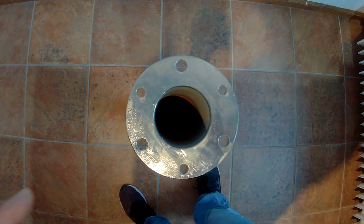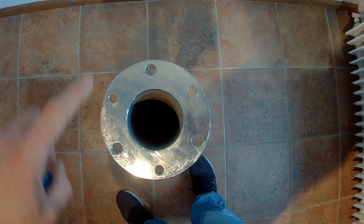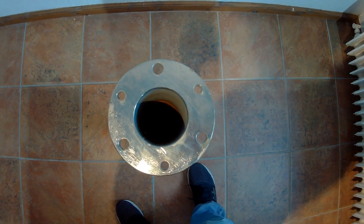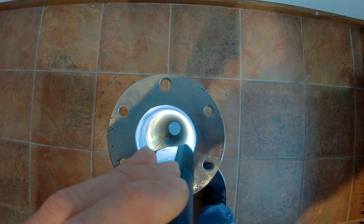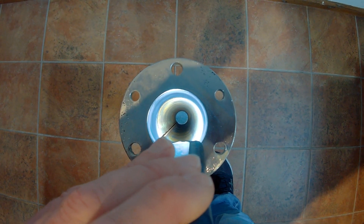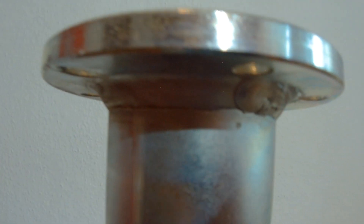Here is the tower in detail. You can see this metal plate which is welded on every single tube on both sides. The bigger holes are for the mounting screws to join the segments together, and the smaller ones are for the guy wire, which is in any case necessary. You can see inside there's a bit of corrosion inside the tube elements — you have to keep an eye on that. That's why I sprayed a kind of primer on all these tube segments before mounting them, given my very salty and wet air environment. The welds look acceptable on all the segments.